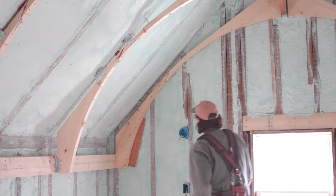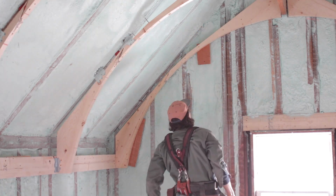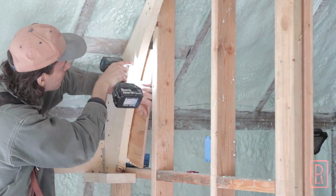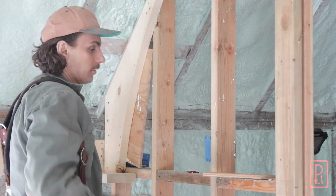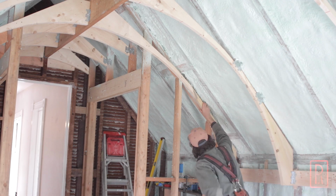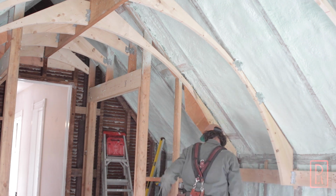The first job was to install sheetrock on the walls that are on the ends of the barrel vault. I did this before installing the purlins, which gave me some greater tolerance for inaccuracies when cutting these sheets of drywall. By installing it before the purlins, I give myself the thickness of the purlins and of the drywall that'll lay on the barrel vault to hide the end of this drywall, instead of having to come back later and fit the sheets perfectly to the curve of the barrel vault. So I first needed to install some plywood backers to screw the edge of the sheets to.